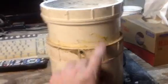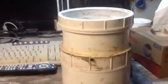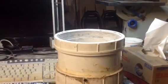Originally I had it just this tall and this cap would have threaded in right here, but I found that it wasn't tall enough for what I'm casting. So I added this section, and basically what I had to do is use a Dremel and eat away at the threads until this fit in there nice, then juice it up with PVC adhesive.